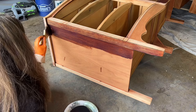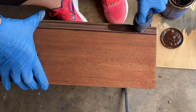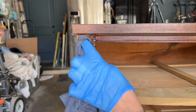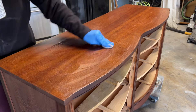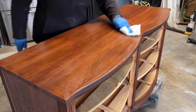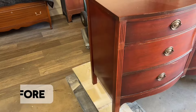For this one, I applied some pewter stain because it had a little bit of blue in it, and I was hoping it would cancel some of that red, which it did in some areas. But then I had to apply gel stain on the pieces of wood that were a different species. Then I simply sealed the whole thing up with the same Osmo hard wax oil — wipe it on, wipe off the excess. The last thing I did was some color correction and it was ready.